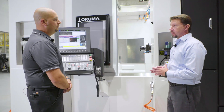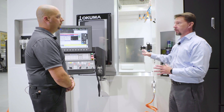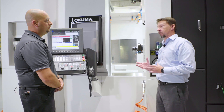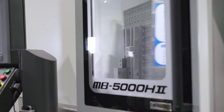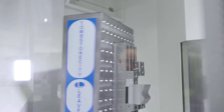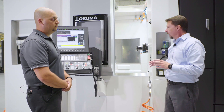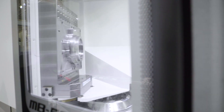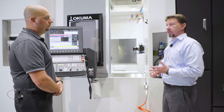This machine is all about speed — combining power, speed, and accuracy. The B-axis is completely redesigned in this model. We've added a cam roller gear to the movement of the B-axis, which provides really smooth operation. The cam roller gear itself has less than a micron clearance between the rollers and the cam, going from zero to 90 degrees in under a second. We've also increased the jerk rates and acceleration rates on the machine itself.